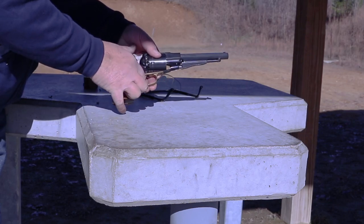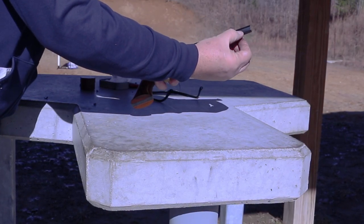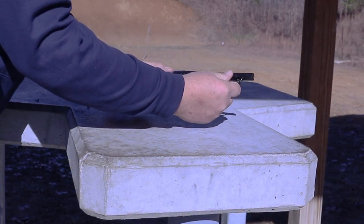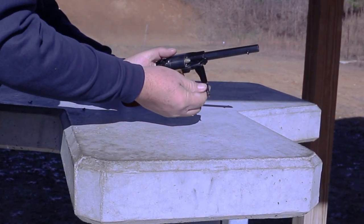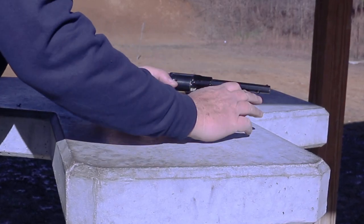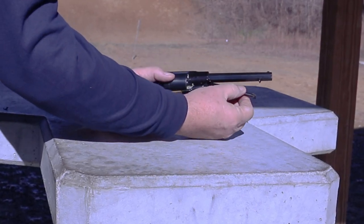I hoped the Euro Arms Remington would not let me down, and this 48-year-old revolver did not disappoint. It was much easier to load — you can see the cartridges go right in. Even with the Remington-style flimsy loading lever, they pressed into the chamber without any trouble, and it was a breeze to load these up very quickly. I found later that the chambers on this gun are all consistently at 0.376 — every chamber is 0.376. I think that consistency and those more open chambers really facilitated loading these cartridges and any other cartridges.